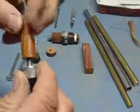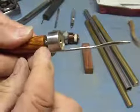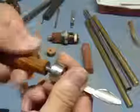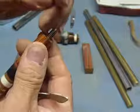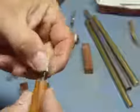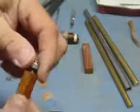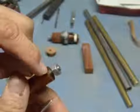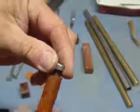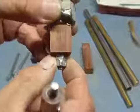And you can take, and you might have to clean up the threads on the pipe tamper itself, and you can use a 1/4-20 die to chase those threads, or you can even use the 1/4x20 nuts, and just screw that back down onto it. Another hard part is trying to get this completely square, level right here. So if you start out level, it usually goes pretty good. And like I said, these actually help you when you're turning that.